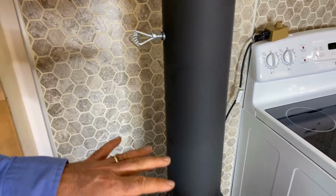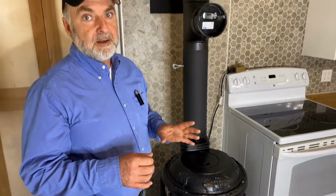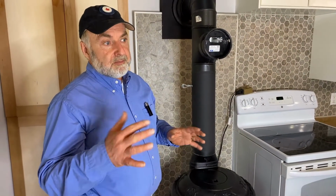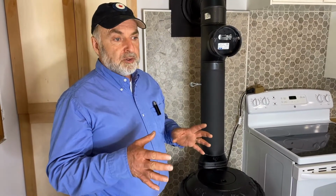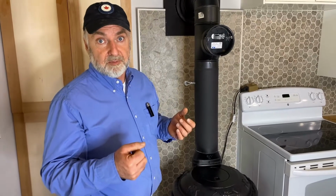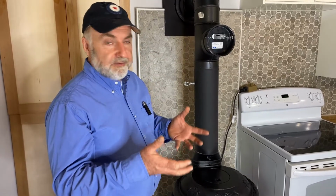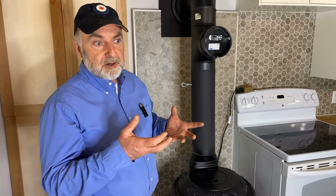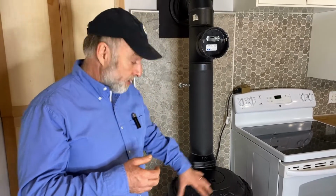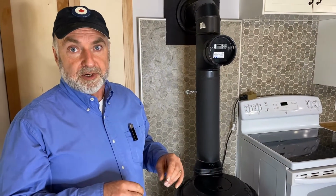The thing to understand about anthracite is that it's very powerful. It's got a lot of heat in it. But besides being challenging to get going sometimes, it's also slower to increase in heat than, say, a wood stove, which you might be used to. So you need to take your time. You need to let that fire build up its heat fairly slowly. If you try to get it to build up heat too quickly, say by opening up the air too much, then there's a good chance that your fire is going to go out.